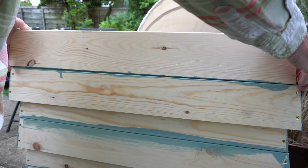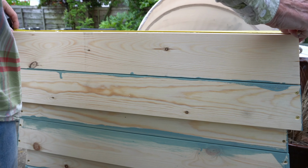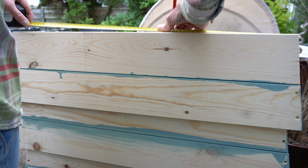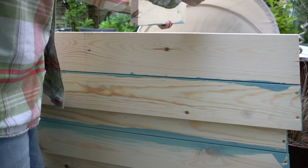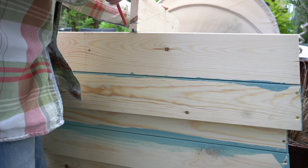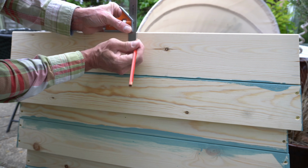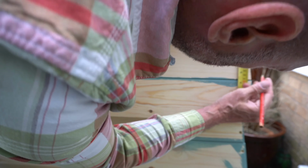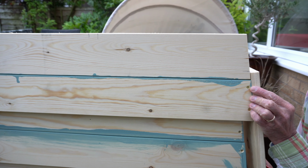Now it was time to turn my attention to the top box, which forms the roof. I built the bottom section up in the same way as I built the previous 4 boxes, but kept the top pieces loose. On the front I marked the centre line and then the thickness of another piece of wood, just transferring these lines down the front. And then at the end I marked up about 1 inch, and then using the 8-degree template just struck a line.